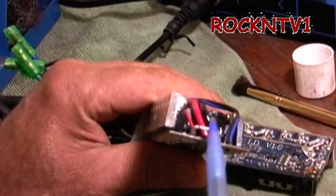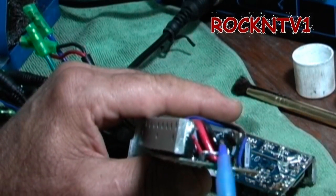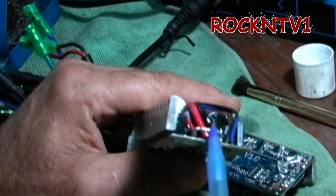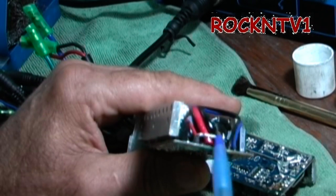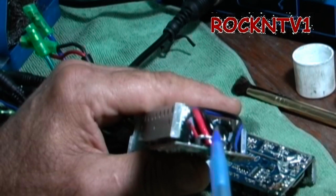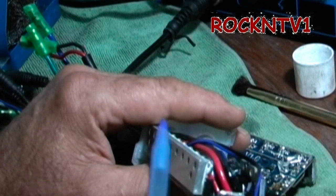This is a 9-FET 48-volt controller specced at 22 to 23 amps, plus or minus one. What the shunt is doing is providing an amount of current and voltage across its length to the rest of the circuitry on the board, proportional to what is coming out of the battery. It then sends that proportional voltage signal to the controller.